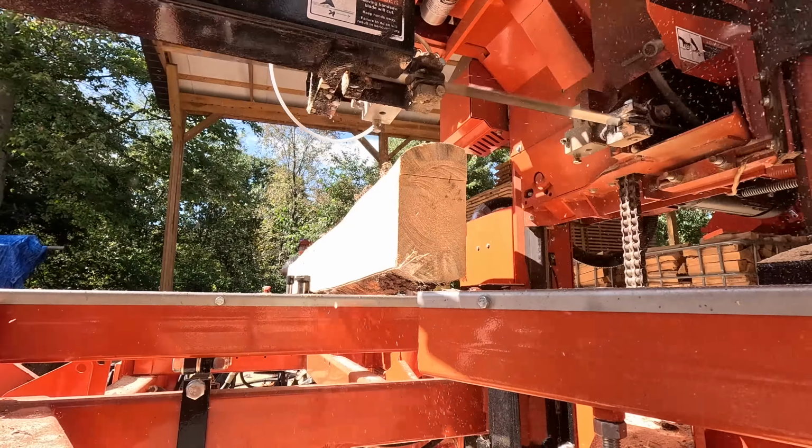So I was going to bring my table saw down, but I'll bring it next time. This works okay for ripping these small pieces. And plus, I have a little bit of wiggle room. Anyway, I'll show you that in a minute. But normally what I do with the table saw is I will rip this piece off right here, just that part of the groove, and then stick it up on the wall, where it meets the ceiling, and just face nail it. But here, I'm just leaving myself a little bit of extra room so I can put it in this way and snap it into place. Because where that little eighth of an inch gap is, or whatever it is, is going to be covered by the ceiling, and then I'm going to have a piece of trim go across it anyway.